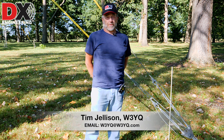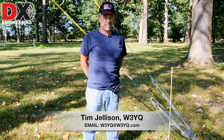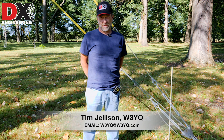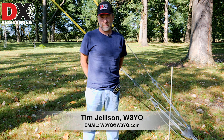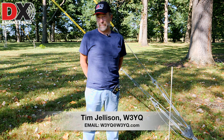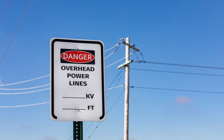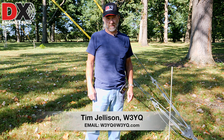When you show up on a tower site, if this is your own property you'll have a pretty good feeling for it. But if you show up on a buddy's place or somewhere you've never been before, there are safety precautions to take before you get working. The first one would be power lines — we've had folks over the years who have been seriously hurt or killed because their antennas got onto the power lines. If you're putting up a vertical, dipoles, or anything, first figure out where the power lines are. You need to stay away from them — they're extremely dangerous.